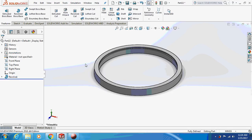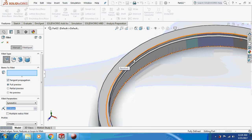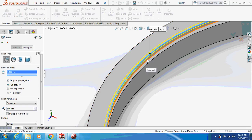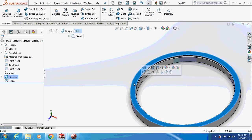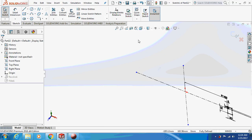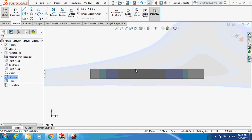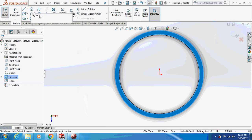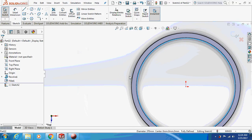Okay. Just using a fillet of 2 mm with this. And the step part. Okay. And select this face, sketch on it. Select this face and sketch on it. Okay, so I'm going to do convert entities. Select this line, so it is converted now to sketch.